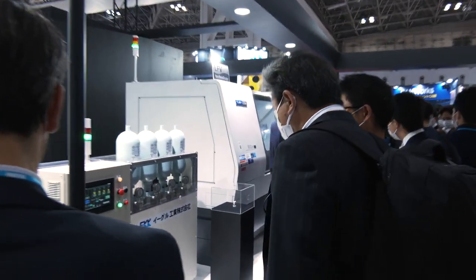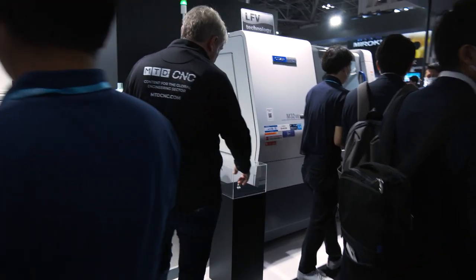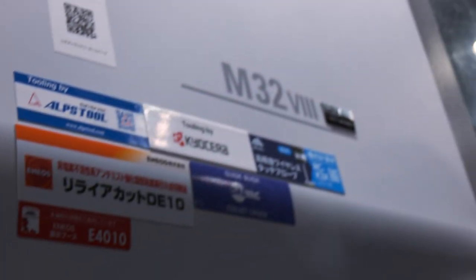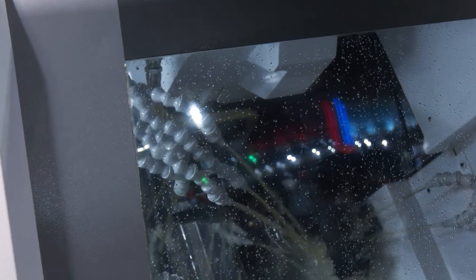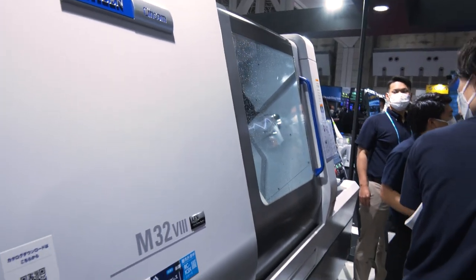M32 Type 8 LFB — their absolute flagship machine. In this machine you've got a huge working envelope. You can get in there and make complex parts — three different tool areas with a B-axis and a turret, giving loads more complexity in terms of machining, but easy to program, which is key. They've got probing in there, so the machine can probe and adjust the way it's working to make sure all your components are done super accurately, 24-7. Keeping the machine running. More automation here.